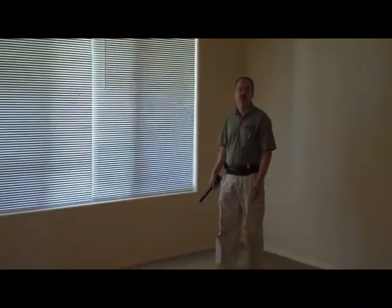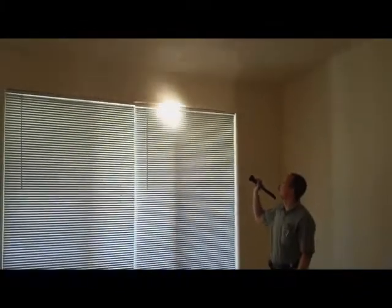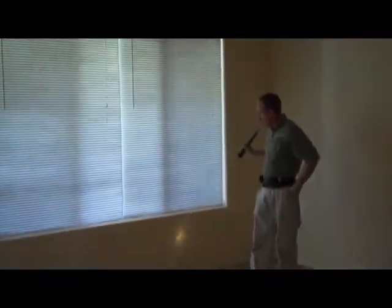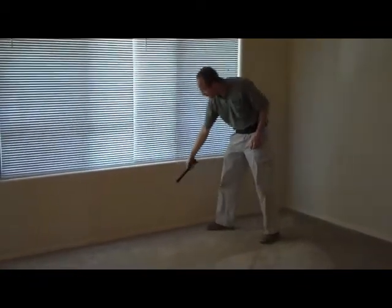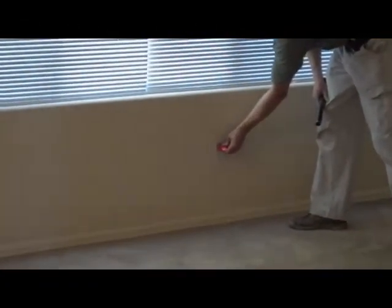On the interior of the house, we're going to check the walls — exterior and interior walls — for any kind of settling cracks and any moisture stains along the ceilings. We'll also check the electrical outlets. In this newer house, there's an outlet turned upside down, which usually indicates that the top half of the outlet works off a switch, so we make sure it's properly wired and that only the top half turns on and off by the light switch.